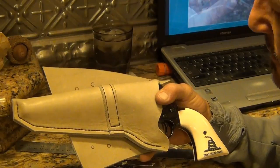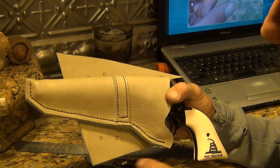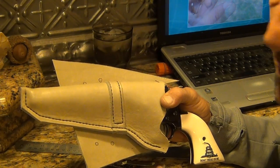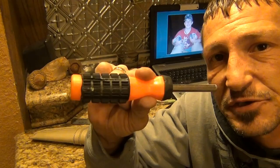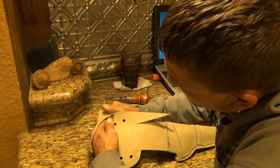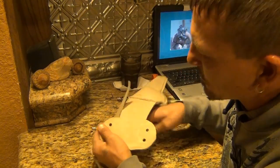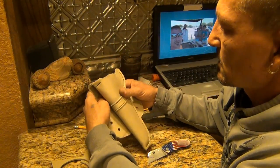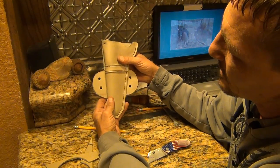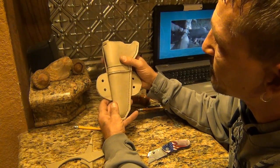Bring it out wide around — this way I can cut my band. So what I've done now is I've cut these pieces loose down to an approximate line, and the same thing on this side. I've marked where I want my band to go, that's going to come across the front. I just took one of these screwdrivers, turned the end down a little bit on my sander, sharpened it up. I've got two more holes to go. It's not quite uniform, but I'm just working my razor knife around to cut it. I might have to alter a little bit — I'll wait to trim the bottom until I cut my pieces in here.